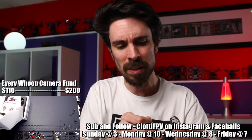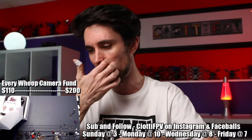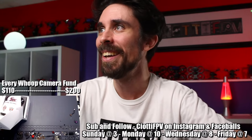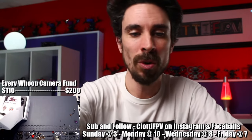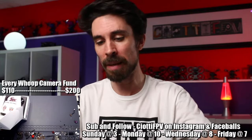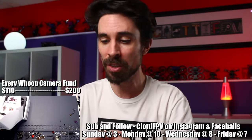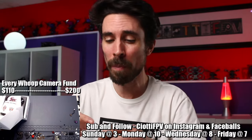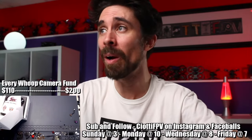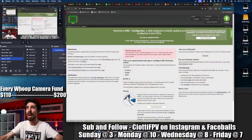I also want to make sure that this isn't on 96 kilohertz because, quite frankly, 96 kilohertz sucks. It really hurts you in terms of motor braking performance, and it makes the flight characteristics worse. It does give you more efficiency and more power, but I would rather have less efficiency and less power and better flight characteristics. So I'm over at esc-configurator.com.